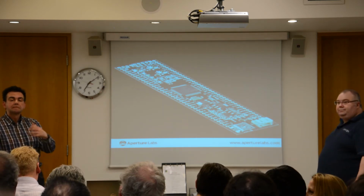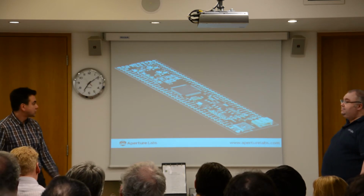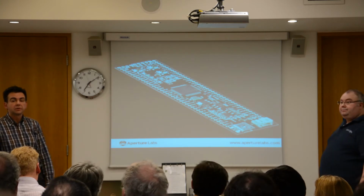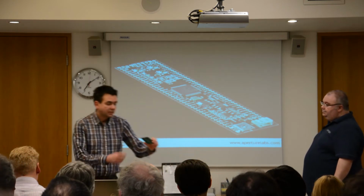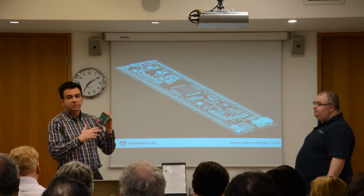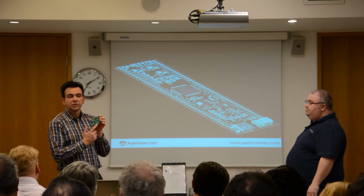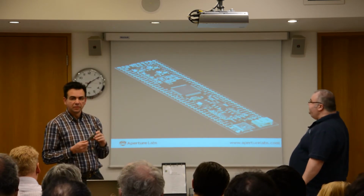So, could you put it through a simple serial? Yes, I mean, it's got hardware and software UART support on it. In fact, RFIDler comes with a USB port, but it also comes with, I'll do a demo, basically there's a menu system, and it auto detects if you're talking over serial USB or serial UART. So you'll flip between the two.